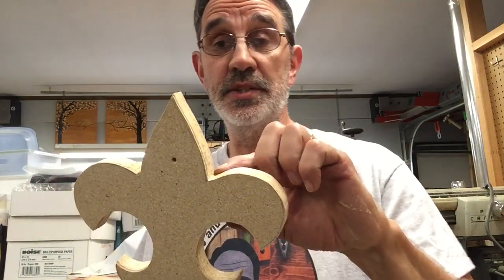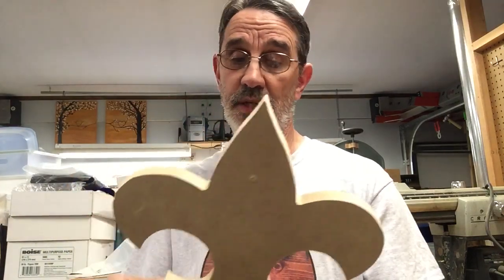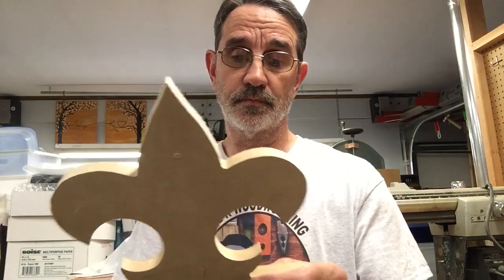You will not get sharp inside corners because you're using a quarter-inch diameter cutter, so you're going to end up with a quarter-inch or eighth-inch radius in those corners. If you want a square corner you can go back on the bandsaw and cut that out. Once you get one pattern, you can screw it onto another piece of three-quarter-inch particle board and cut it out on the machine, and now you'll have two identical patterns. You only have to make one regardless of how many patterns you want.